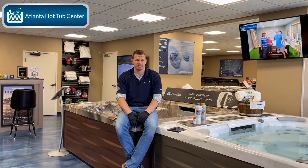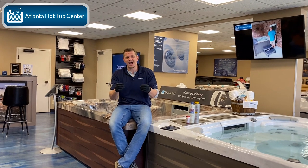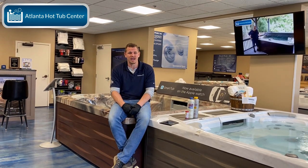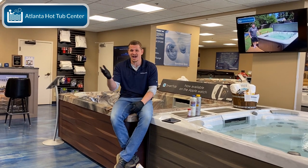All right, and now let's talk about if calcium levels are too low. If they're too low, guys, normally what ends up happening is it's corrosive. And if it's corrosive, it can corrode glue joints, your heating element, and so forth. So it's very important to not let it get too low. Now, if it's a little high or a little low here in Georgia, coming off the street, we normally don't tell customers to mess with it. But if it is high or low, very obviously one way or another, we need to adjust it. And we're going to talk about adjusting calcium today in a hot tub and a swim spa.